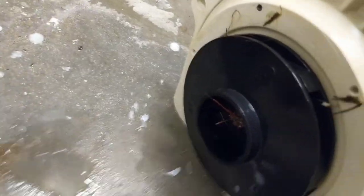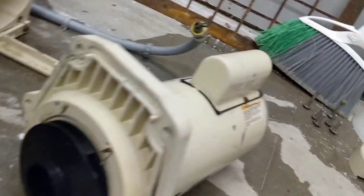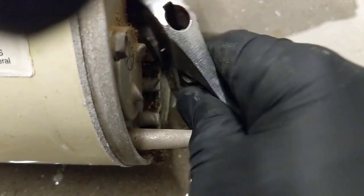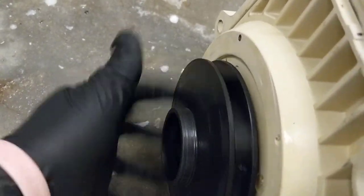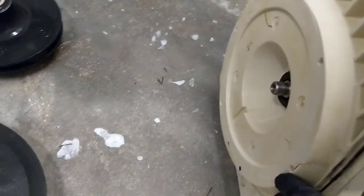And we can pull that off. There's a Phillips screw right here which is a reverse thread. So in order to get that off, you're going to want to put a wrench on the back of the motor right here on the shaft to make sure it doesn't turn while you're trying to spin that off. I'm going to need two hands for that so I can hold the wrench and take this out. Now that we have that off, you want to spin off the wheel here, but you want to make sure you have a wrench or crescent wrench back here holding the shaft still so you can thread this off. And then we want to pull the seal plate off.